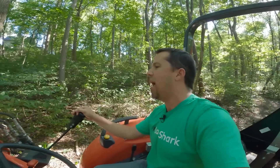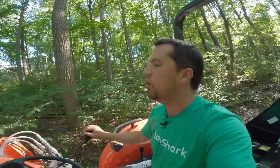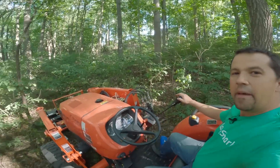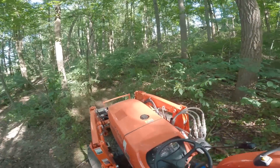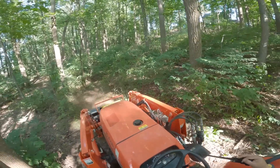As far as operating technique goes, one thing to keep in mind is the impact these forces have on your loader. What I typically like to do is drive into the brush with my loader pointed up in the air, have it cut the brush, then tip the loader down and back-drag the loader out of the brush to cut close to the ground. That way, as I'm backing up, I'm not digging that mower deck into the ground and potentially pushing weird forces back into my tractor and loader. So: in with it, tilt it up just a little bit, and once you're in and done that, tip the nose down a little bit, back out — and that's what actually grinds up the briars as you go. You can see that does a pretty solid job.